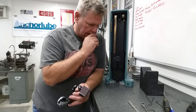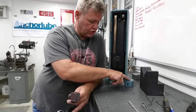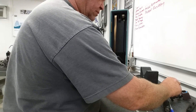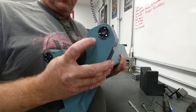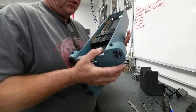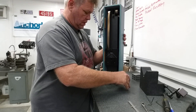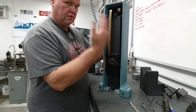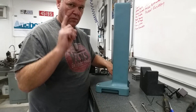I can adjust bottom and adjust top. I've got it dialed in pretty good on the side-to-side axis. We're adjustable on our feet — it's a three-legged mount. There's a swivel mount right here — you see I'm tipping that around and it's on a ball and socket. That's adjustable through this hole right here with an allen wrench. You just drop an allen wrench in there and you can adjust it on this axis. Then in the back you adjust on this axis. These only have one turn of travel.